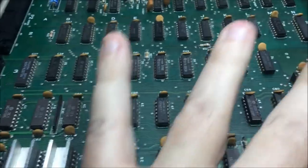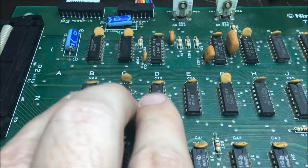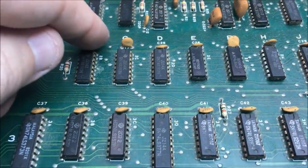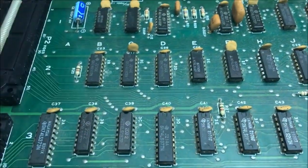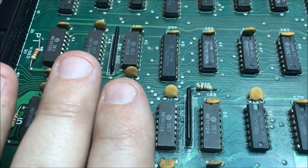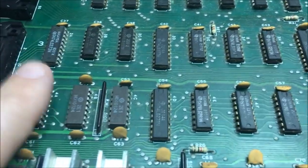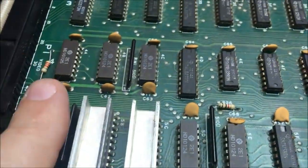And I did double check my voltages on this whole board, and I actually probed all the voltages of these 3 chips, and they're all where they should be. I got 5 volts and ground here, and all of the signals are well within 0 to 5 volts, and they're just hot. These are hot, but they should be hot. They got heat sinks. But they're not as hot as those other chips, and everything else is. Ooh, that's hot. Yikes. Ooh, those are hot.